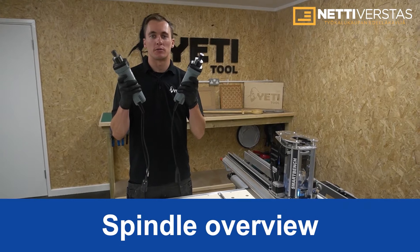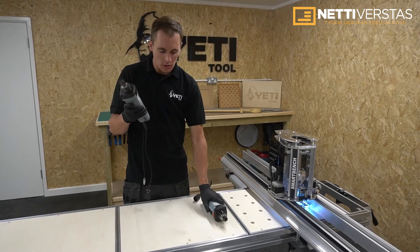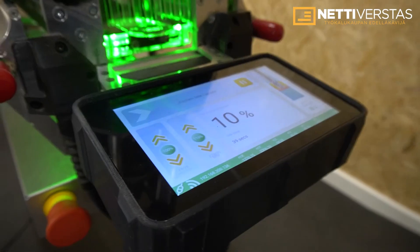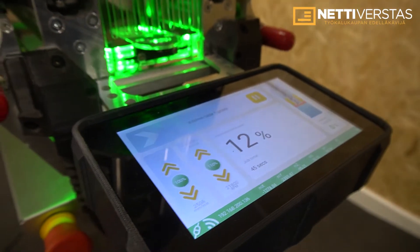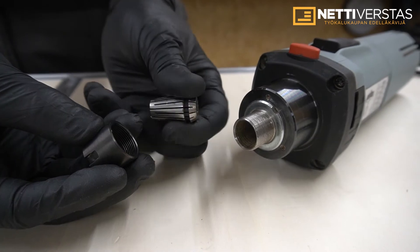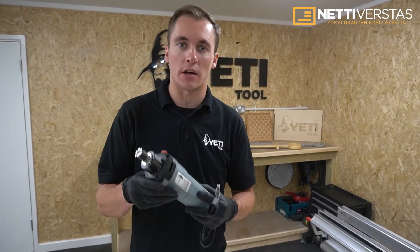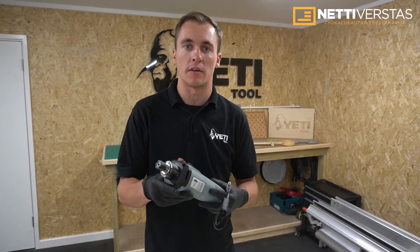We offer a choice of two spindles with SmartBench. The SC0 has manual speed control and has the budget user in mind. The SC1 is the perfect match for SmartBench — it has digital speed control which unlocks the full potential of CNC routing, allowing SmartBench to control your speeds live in a job so you can optimise your feeds and speeds automatically. Additional features include the ER16 collet system for easy tool changing and uniform clamping, and most importantly, spindle overload protection which monitors temperature, current and spindle speed and will automatically pause the job if any of these peak.